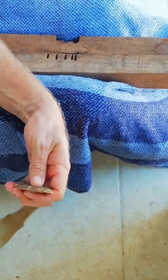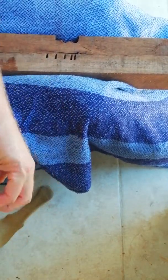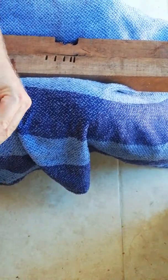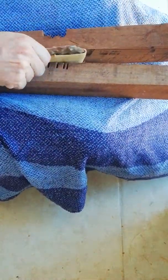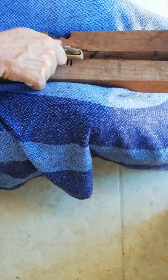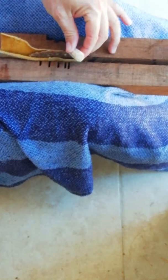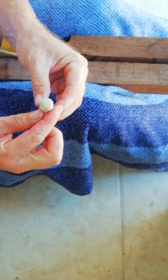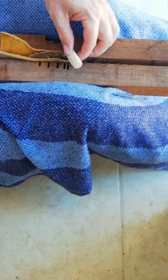I don't have a hammer still on me, but I would kind of rough up this easy edge. Now let's see if it works. I want to put this in this piece of leather to help grip the piece. I don't think leather has to be used, but this is experimental so it's not going to hurt me either. Now I have a pretty good grip here, gripping about halfway up the edge of this wide face. I'm going to shoot towards the center. Here's my antler drifting punch — it's cylindrical, the end has been ground flat so I have a shoulder, and that shoulder ideally should catch this edge.